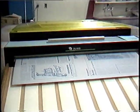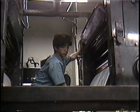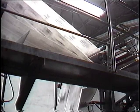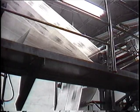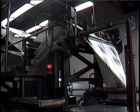These plates are the final step to printing the paper. Once they get installed in the rollers of the huge press and initial adjustments are made, things begin to happen. The eight presses print four pages each, but since the Stripes is only a 28-page paper, one of the presses runs the additional colors, which is normally red and blue.